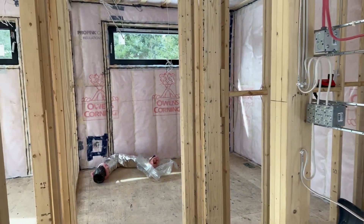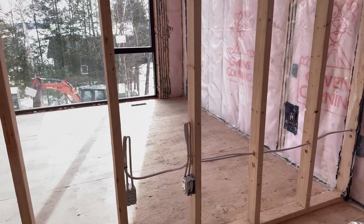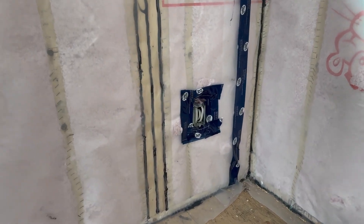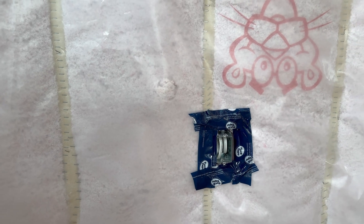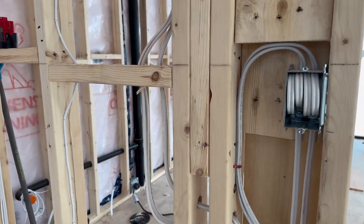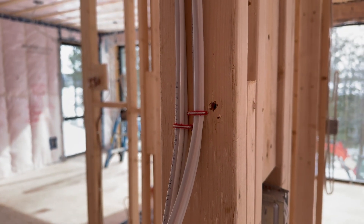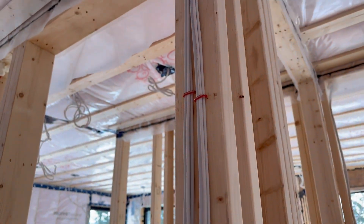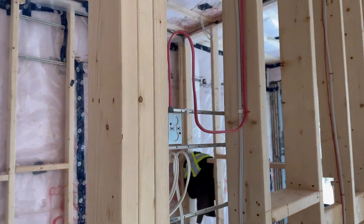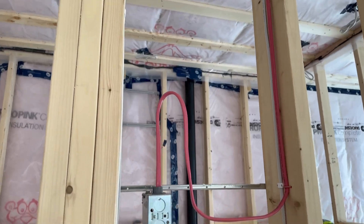I will also show you some of the wiring and how we like to do it. Most of the time we keep all our wires straight — we use a laser to drill the holes and we vapor-boot all our exterior receptacle boxes and lighting switching. Anything that is exterior has to be vapor-sealed. We also try to keep all our wiring neat. Here we have some of the new Milwaukee staples; I got the stapler a few days after starting the rough-in and I love it. At the end of this video I will share what I'd like to do for tool giveaways, so please subscribe, like the video, and stay tuned.